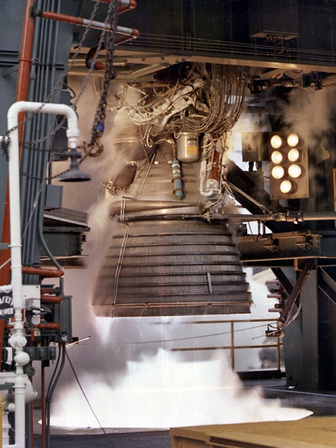The third stage also operated at high thrust for the majority of burning time to realize high thrust benefits. The exact period at which the engine operated with the PU valve closed varied with individual mission requirements and propellant tanking levels. The propellant bleed valves used in both fuel and oxidizer systems were poppet-type, spring-loaded to the normally open position and pressure-actuated to the closed position. They allowed propellant to circulate in the feed system lines to achieve proper operating temperature prior to engine start. At engine start, a helium control solenoid valve allowed pneumatic pressure to close the bleed valves, which remained closed during engine operation.